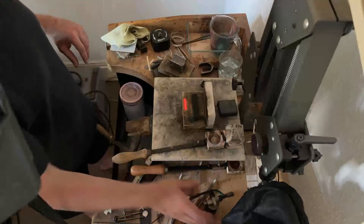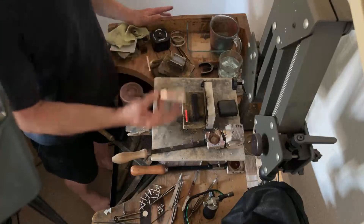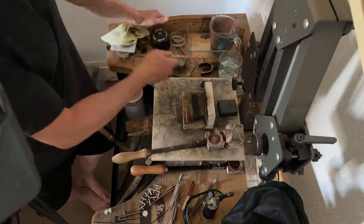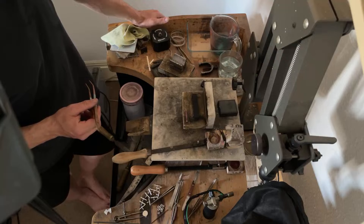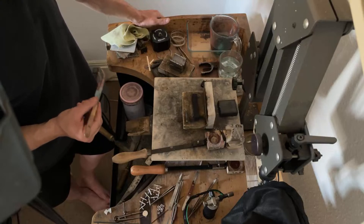That should do it — should be nice and soft. Just push that to one side and cool it a little quicker. I want the redness to subside a bit before we quench it and rapidly cool it in the water. I think cooling it too quickly — when it's red hot — can actually make the surface a little bit brittle, primed to cracking.